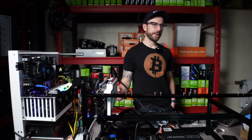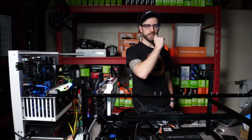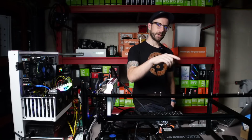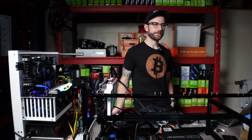Tandy Man, question about the power meter wiring. Where does the ground wire go when you wire the receptacle? The ground wire just goes essentially from the plug through, and then it goes into the ground wire of the receptacle itself. Doesn't have to go to the meter box.